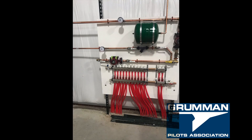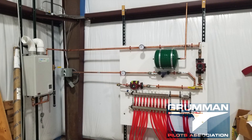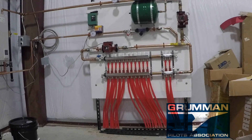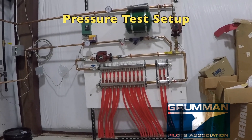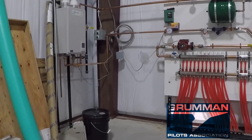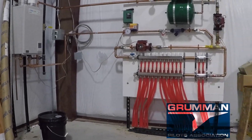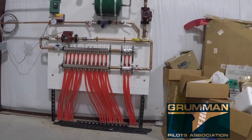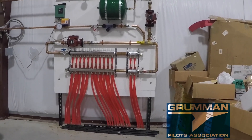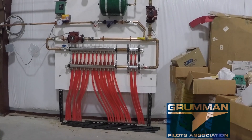As the manifold board is being laid out, we get water from the hot water heater — it comes in, goes by an expansion tank, goes to a pump, and blows around into the floor. A return pump pulls it back out. When we got it all put together with the Y-strainer, we did a pressure test, and it was during the pressure test that we found four leaks — because the one-inch pipe was BSP on one end and NPT on the other.